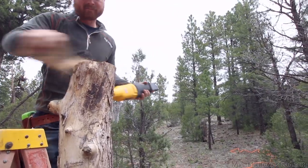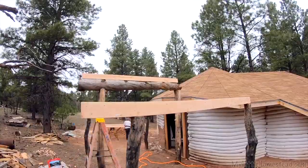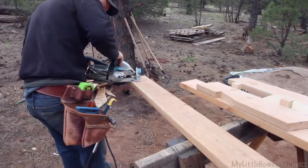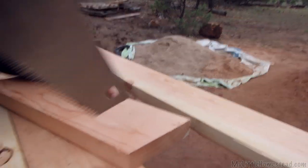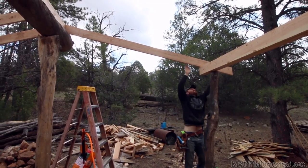I'm not going to mention who overbought on that — it wasn't me. Now we can build this into a really cool shed roof. We'll set a beam on top of this beam — put a two-by-six on top and the whole roof will set on this main log. We'd talked about an outdoor kitchen with an awning over it, but we're going to wait on the kitchen and go ahead and get the porch done. It's the way coming into the house, so when it's raining you can get out of the rain. It could also be used as a carport.